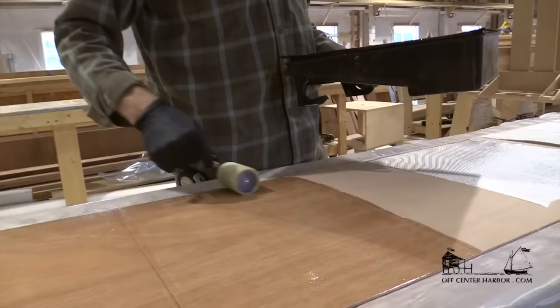You can overwork it, so don't. On smaller parts I use a foam brush for tipping. On larger areas — like with varnish — you would roll a section about two feet wide, tip that out, move over, roll another section, and overlap your tipping, just like varnish. Many thin coats is better than one or two very thick coats, especially when finishing something bright.